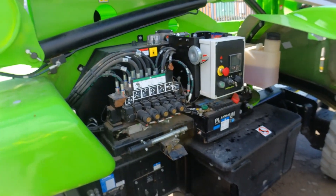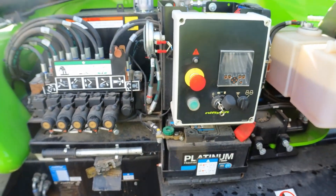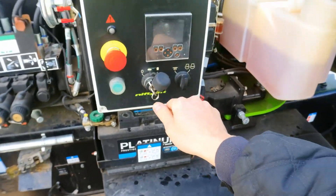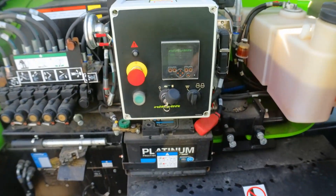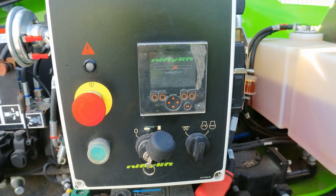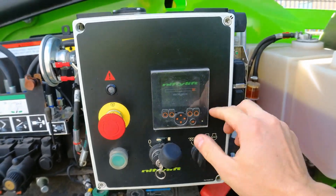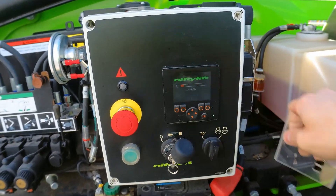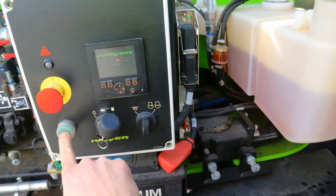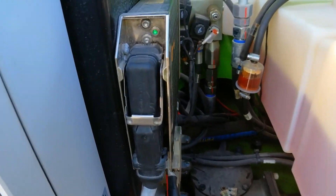I have this HR21 hybrid machine and it has a fault with the control side. The machine has been rolled in — the gearbox is disengaged so it's been pushed in here. When the machine starts up, it displays a communication error on the display. If I push the green button, nothing happens — the electric motor is not running, though the PLC is flashing green.